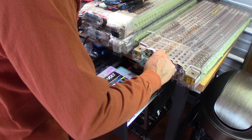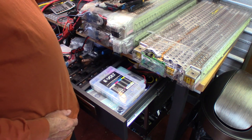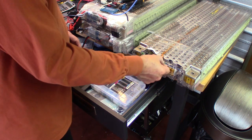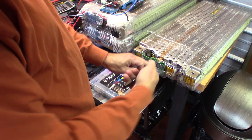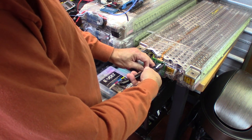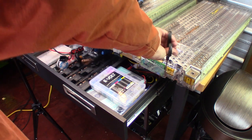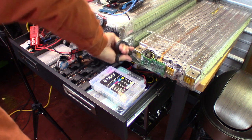So the first thing we're going to do is remove that factory BMS board. Tesla's kind of particular when it comes to programming it, and replace it with one of our own BMSs that I custom programmed. In order to do that, we're going to pull these little black pins that are on the side of their BMS board. They're just pop pins. They pull right out, and then you can grab the main base of them, pull that out. But first, we're going to cut back this plastic tab on the bottom. Just makes access to the whole battery a little bit easier.